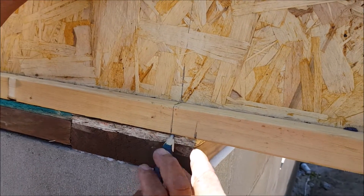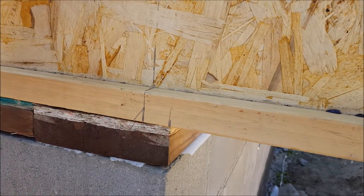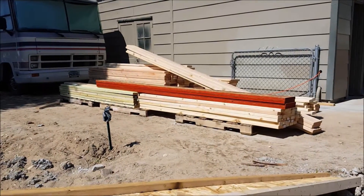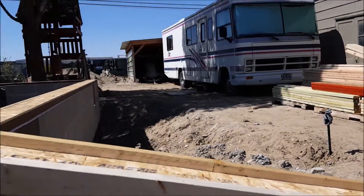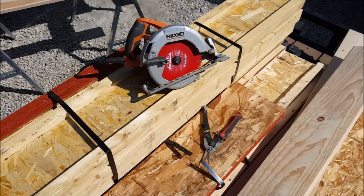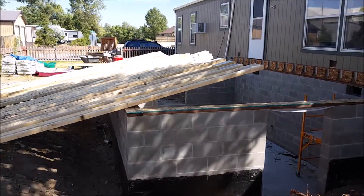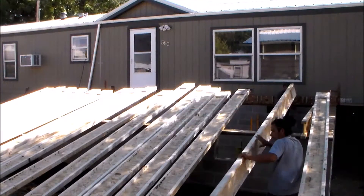At this point, I'm just about ready to start rolling an i-joist into position. If you don't have much experience cutting an i-joist, it would probably be a good idea to cut the i-joist first before rolling it in place. To cut an i-joist, you can use a standard skill saw by cutting on both sides of the joist, or you can use a sawzall or even a chainsaw. But the cuts need to be nice and square — if a cut is too crooked, the i-joist may become unusable if off more than a quarter inch from being square. Since we do have some experience, we're going to wait to make our cuts until after rolling them into position.